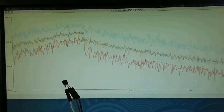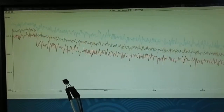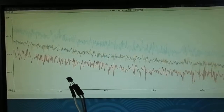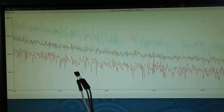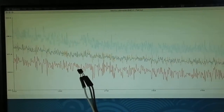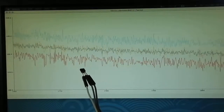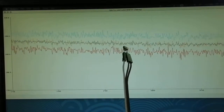The forced air reaction rates are much higher, and we're going to have this thing in a tube with a 60-watt bulb and a couple of computer fans, so there should be a lot of forced air around it. So we're expecting rise times within 5 seconds, but if we're tracking fall times, you might have, like, 60 seconds, a couple of minutes of lag, something like that. Forced air should be a little bit faster.